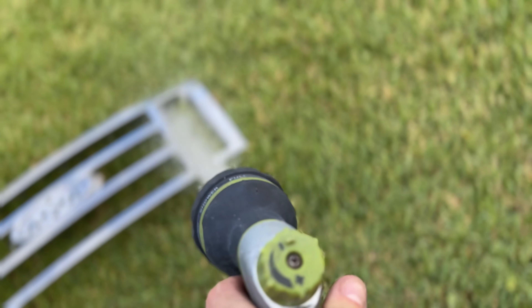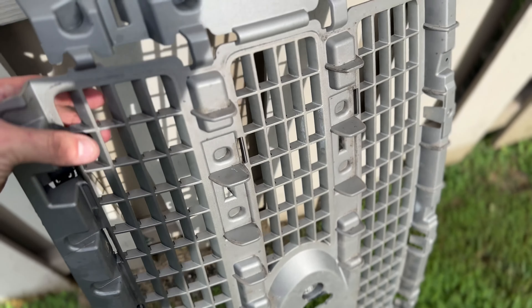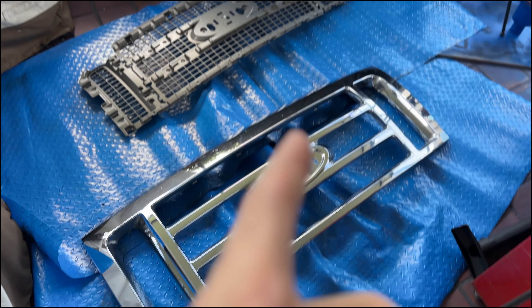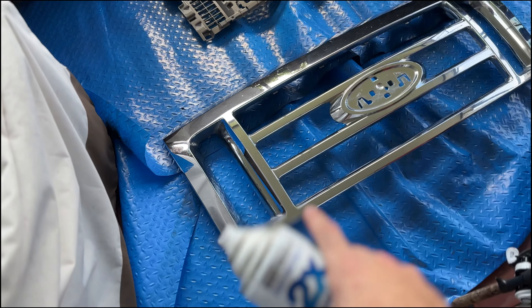Make sure you get both sides, then take it and put it in the sun so it can dry for a little bit. Now I just got to spray this one down - I already sprayed it with water but as you can see it's still dirty so I'm going to clean it one more time. I did do a light sand on this one. Then we're going to start with primer to make sure it sticks to plastic, and we're going to do both - just one coat. I normally don't do primer on stuff but this is a metallic silver so I've got to.